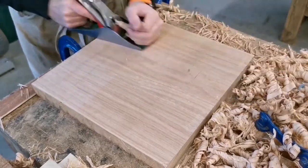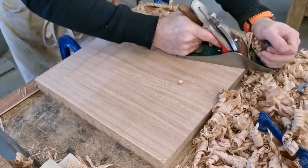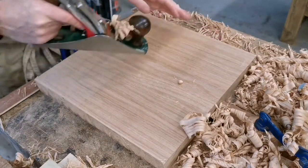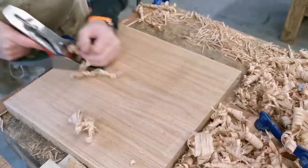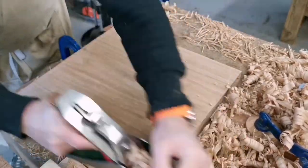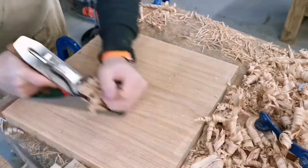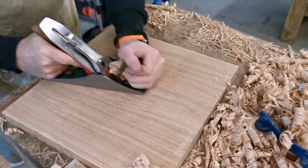Some of you will have noticed I've not gone over with winding sticks. I'm not worried about that just yet — I'm just doing this initial process of taking the rough timber off and getting somewhere near flat. You'll see in a little while just how I address the surface to make sure it gets exactly flat, but at the moment I'm just getting rid of all those ridges from planing and tidying it up.